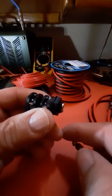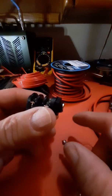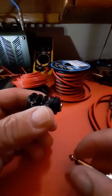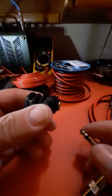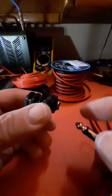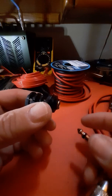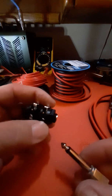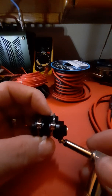To disengage and re-engage your internal speaker, just disconnect your cabinet. Very important: make sure that you match the impedance of the cabinet. In my case both amplifiers are 8-ohm, so I want to get an 8-ohm cabinet — or 16-ohm is fine. Never go lower than 8 ohms; 4 ohms is no good and can't be used. Otherwise you'll damage your amplifier.